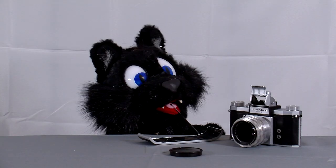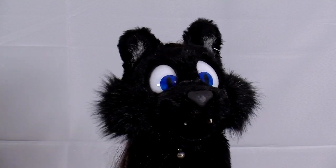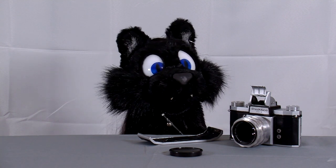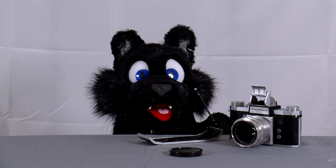This enables the rather low exposure times. The closing curtain will follow the opening one within the frame, resulting in a rolling shutter. And you kids thought that was a DSLR thing. All of this is achieved 100% mechanically. The camera has no battery. The only wiring is for the flash contacts. Oh boy, this is going to be an interesting one.